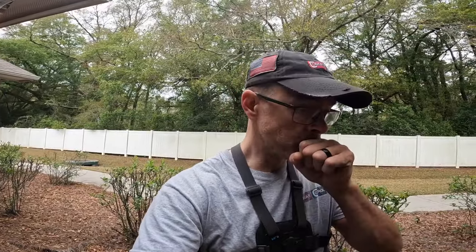All right, so I talked with the tenant here, and from talking to her and what I found when I first walked up on this, if you remember, the contactor was pulled in when it shouldn't have been. That's because I had trouble with that board, and I moved one of the wires to bring on the air conditioning, and I caused it to run constantly. And then the tenant told me that she didn't smell smoke, but it was like foggy. So the coil had been icing up, and she had vapors coming off the coil, coming through the return into the house. So that's what it was. It was my mistake. And I have it turned off at the thermostat now.